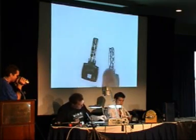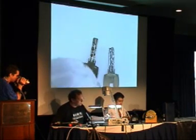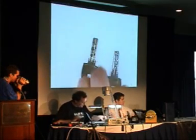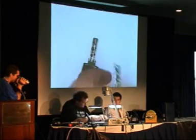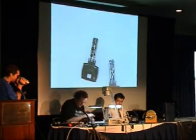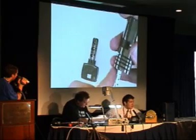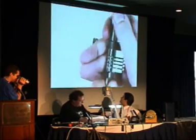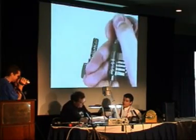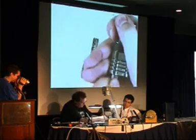I'll show you what I do. I put some of this aluminum foil — the type used in the car and heating industry — over this blank. As you can now see, it's covered. The trick is that the area where the key will enter the lock has to be perfect, because that's where it will probably jam if something goes wrong. Now the prepared blank is in the lock, and I will wiggle it.